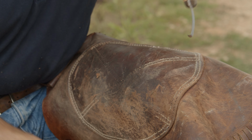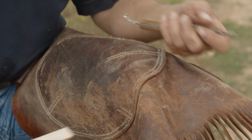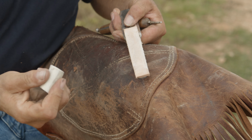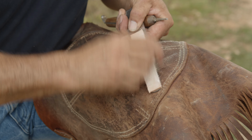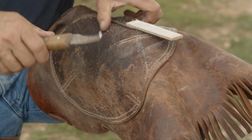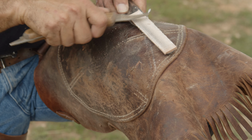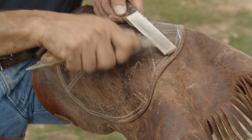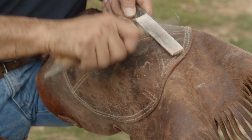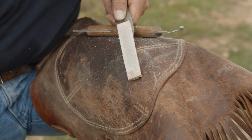But you'll see that you won't be able to feel a wire edge because pushing into the blade has kept it from forming. Once I have that, I get a strop. After your strop has been loaded a few times, it actually gets better. The first 10 sharpenings, your strop will not be as good as it will be after you get it loaded down pretty good. So I hold the strop on here and I push this way. That's only one stroke, but you can see that black that came off of there. That black is metal that the jeweler's rouge is removing on a very fine scale, which is what makes it so sharp so fast. I'll just scrape it with the back. With a brand new strop, I tend to load them a lot more. Once it's been used a few times, you don't have to do that.